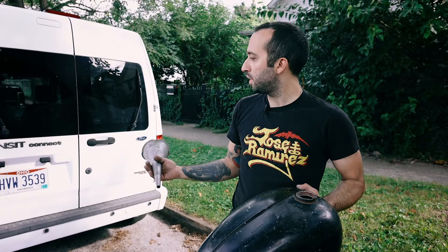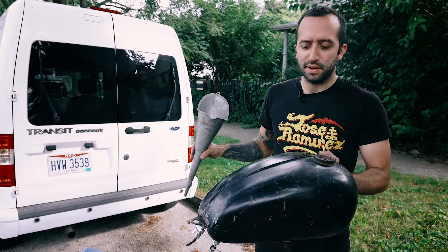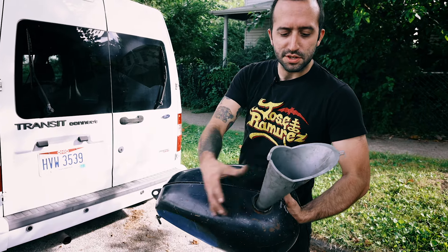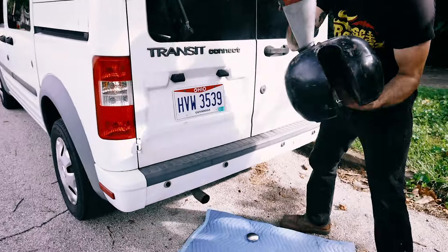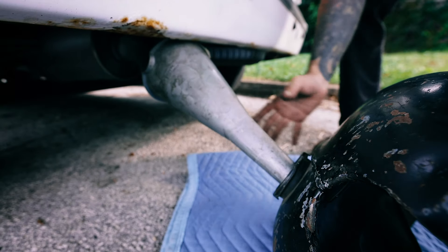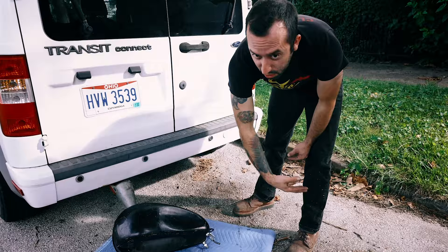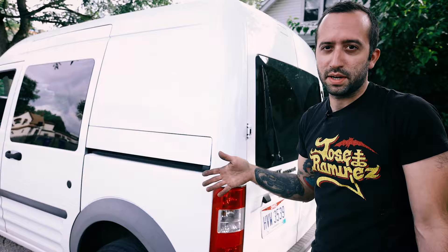This is very easy to do with your car. All you need is your funnel, your gas tank, and I brought out a furniture pad in case your gas tank is painted nice so you don't ruin it. All you got to do is stick the funnel in the filler — this just helps direct the exhaust into your gas tank. You're going to lay it down on the ground and put the funnel over your exhaust pipe, then make sure to open your petcock so the gas can flow all the way through. The exhaust will just push all the fumes out of your gas tank.